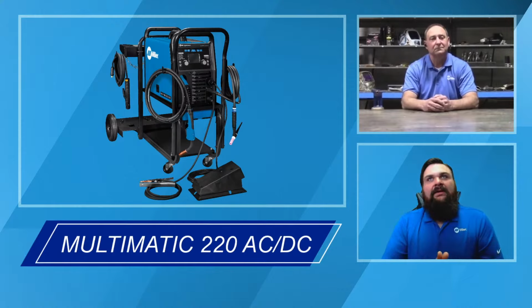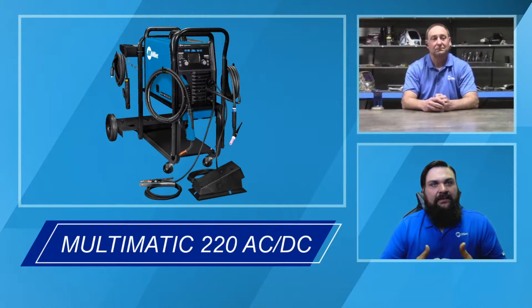But a few other things that we gain coming to an inverter, like we had talked a little bit ago, size is something that's pretty big. A lot of people in their home shop don't have room for another refrigerator size machine out there, or the power to draw for it. If we look at some of these older style TIG machines, especially when we get on AC and get out of balance, they really start drawing some input power. So a machine with a similar size output to the Multimatic 220 AC/DC back then, you could have running off a 100 or 120 amp breaker versus a 30 amp breaker.